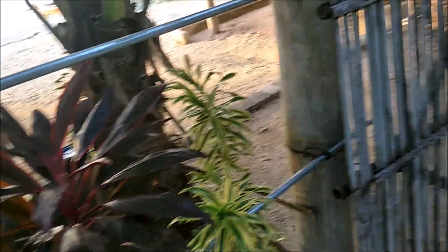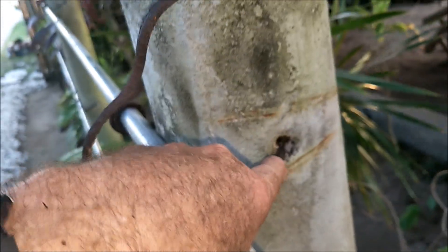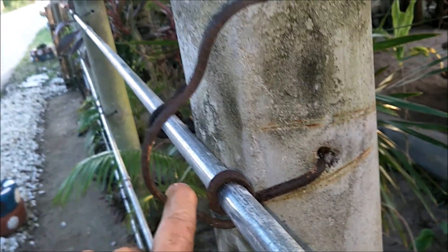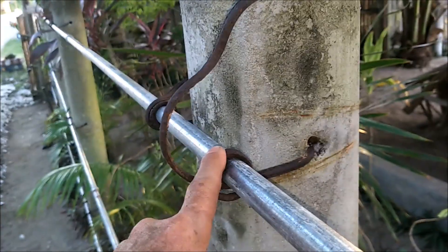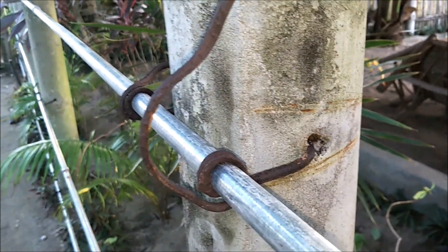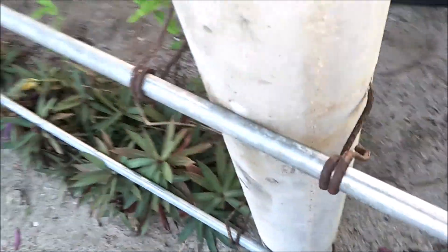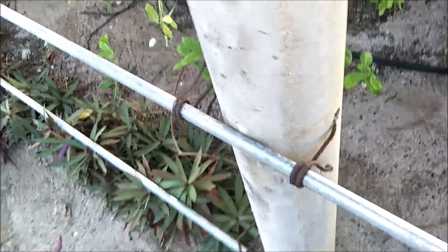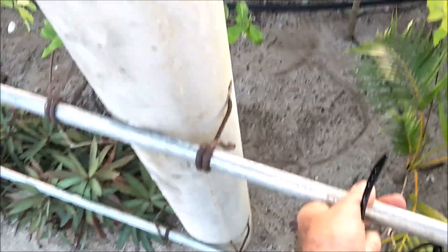That's what we've been doing the last two days. The way we attach it: originally we had holes through the concrete poles and put 8mm rebar through, then tied the bamboo to it — because there's no other way to connect bamboo to a concrete pole. We still have the 8mm rebar going through; it's a bit rusty but still good. We wrap it up real tight with a vice grip trick to pry it snug, and then it doesn't go anywhere — really solid.